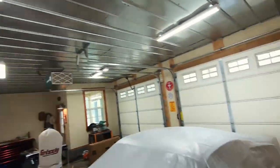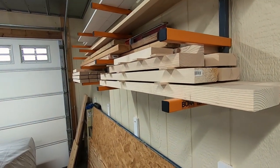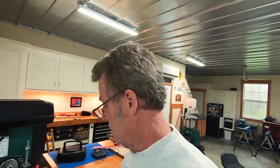All right, all our leg and stretcher material is cut down, rough cuts. I got it stacked up here with some quarter inch sticks that I cut. We'll let that sit probably about a week or so. That came out of the Lowe's. It was inside, so it wasn't like it was sitting in a lumber yard, so it's not gonna be as wet as some of them.